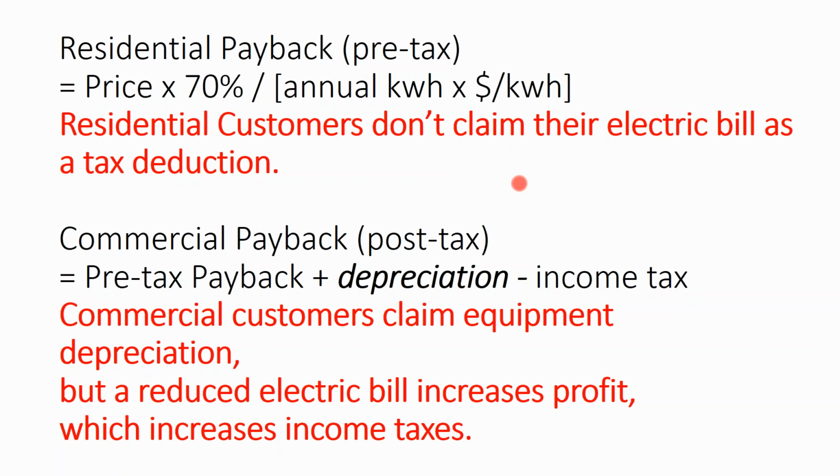You don't connect it to your home. They put a standalone service on a small solar array. It's actually a costly policy, and it strips the backup power capability of the array because it's not connected to your service panel anymore. It's not a good policy. And the alternate is to interconnect the array on your load side and get avoided cost instead of retail for your outflow. And so it's problematic because customers have been participating in the near retail program, but as the value of the program has come down, the participation is now non-existent, but they don't have the paperwork in place for the load side connections.